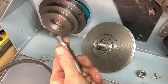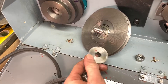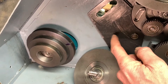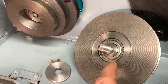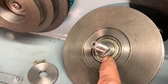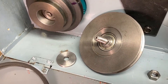We remade the jockey wheel's little spindle, bored it, and put seal bearings in. We put it on with a right chunky washer to give better pressure on the supporting plate. The old lugs were a bit shallow so it didn't engage far, and the new lugs are just deeper. So: new bearings, bigger lugs, chunky washer — job's a good'un.